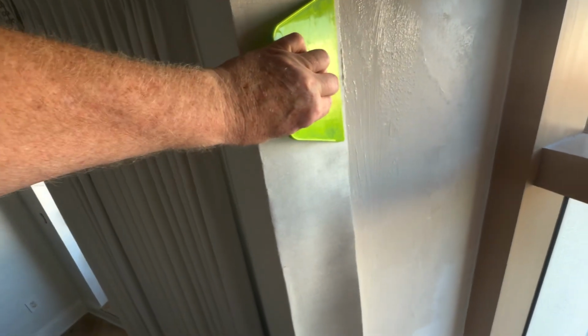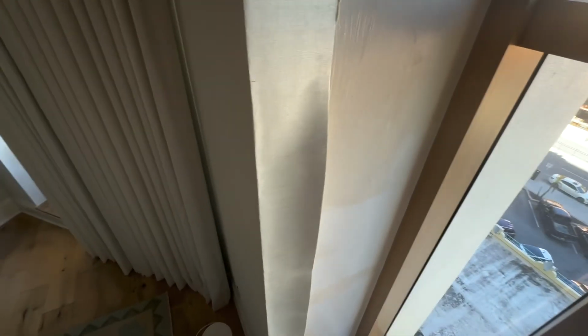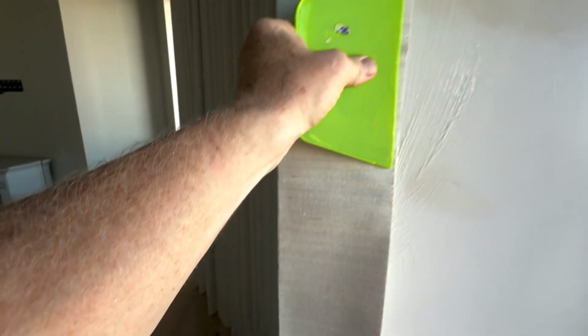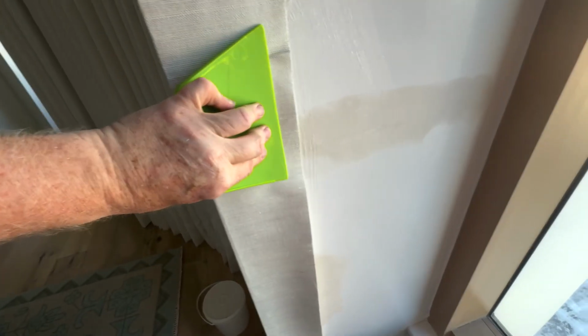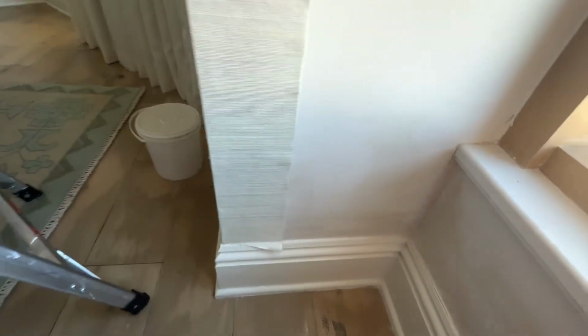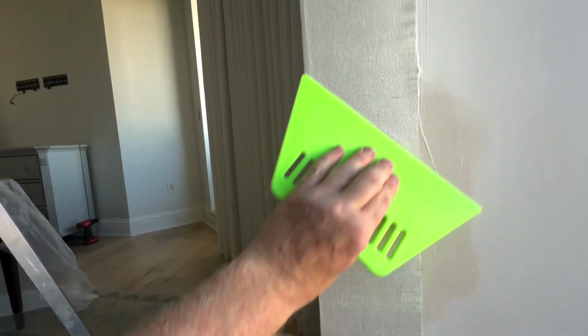Okay, so I just put some clay-based paste under this one. I'm just giving it its final smoothing out. Some grass cloths can be cleaned, not this one. So you don't want this stuff on. It's great when you can just clean it. But we're going to be trimming this, right? Okay. Wipe the smoother off. Go for it. Press hard. Nice.